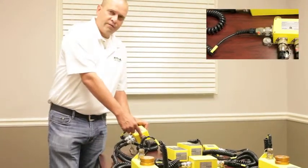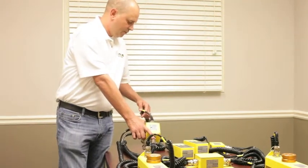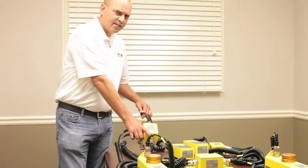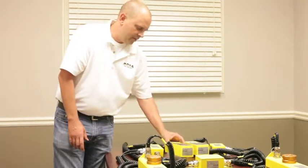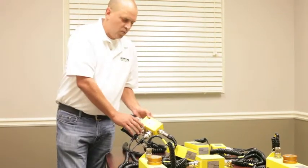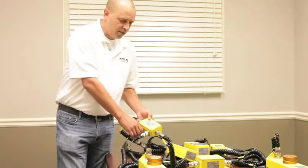The port here on the far right. On the left side of this you will see the exact same cable coming out — this is a 040-2-02560 power cable that will go into your right side controller. On the right side junction box you will see two ports: one that is a grade and one that is a slope. Make sure that you have your grade plugged into the grade and your slope plugged into the slope.